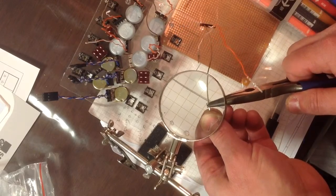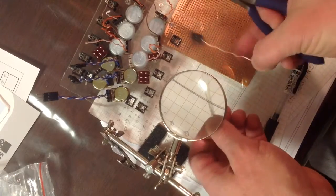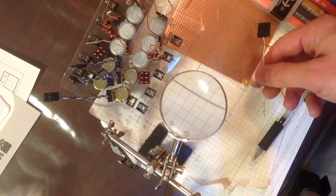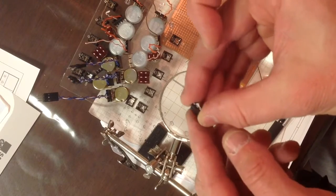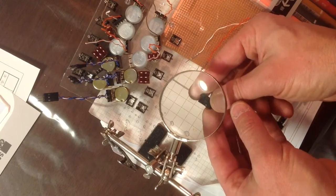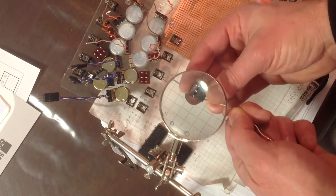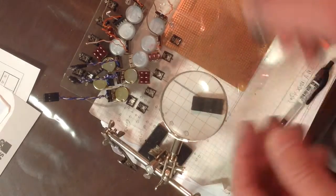Now you might need a little minus screwdriver or something to push the Molex into the housing at the end of making it fasten itself. And I'll show you that here, pulling out the plastic housing. And there are little lips or tongues that are separating. You can see that right there. They have a little notch on them at the inside that will hold them in place.